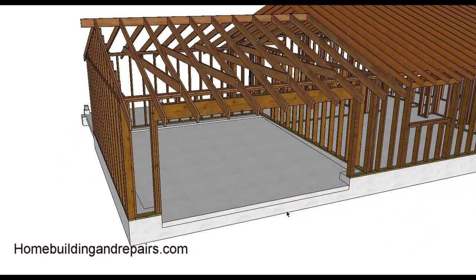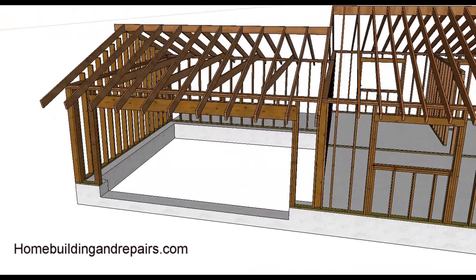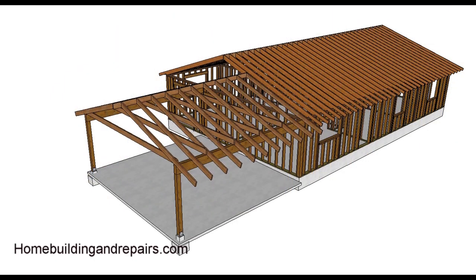The slabs for a carport might be separate from the footings because they're not going to have any footings. The slab in a garage is usually poured after the footings. Here's what a standard carport design might look like: posts supporting beams that support the roof rafters, with rafter ties, footings, and a concrete slab. Look at how the post and beam might be connected to the house - the top of the beam might be the same as the top of the walls to make the roof assembly easier.